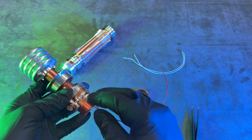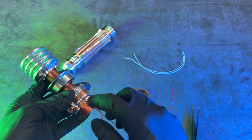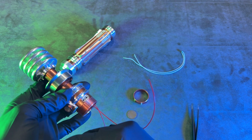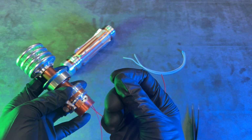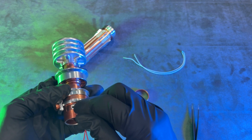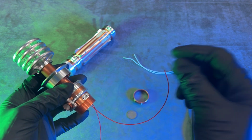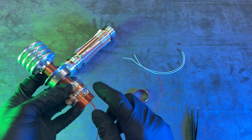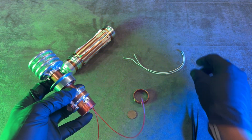Now, Tony and Starkiller want me to do this instruction video. And when I took the shroud off, you'd see this mess of a job I did sanding away. So I just went over to my mill and took a very light pass off of it, so it's much cleaner for the video. But realistically, all you have to do is take some sandpaper. I folded it up like a triangle and scrubbed away in there. You can actually still see where the plating is left behind that I didn't touch. I scrubbed away with the sandpaper, and in maybe 2 minutes I had it working just fine. So that's why my pocket looks a little bit different than yours. But realistically, all you got to do is sand the plating off, and the switch is going to work just fine.